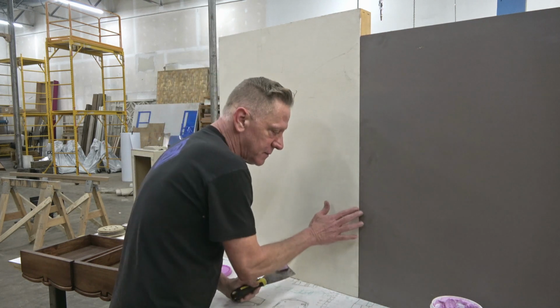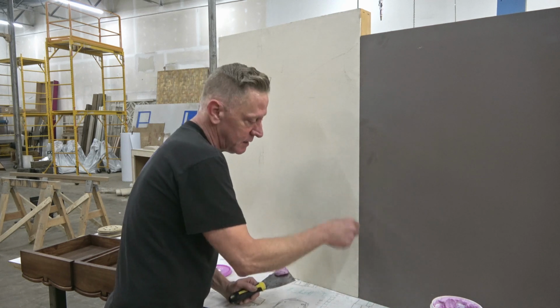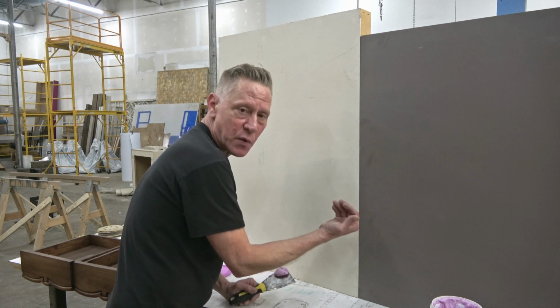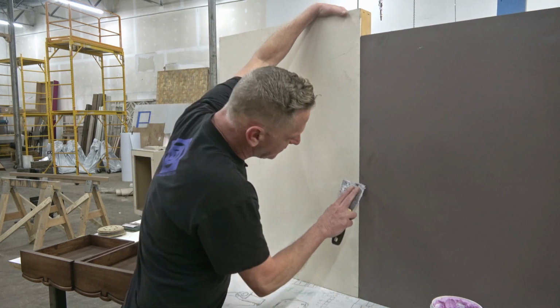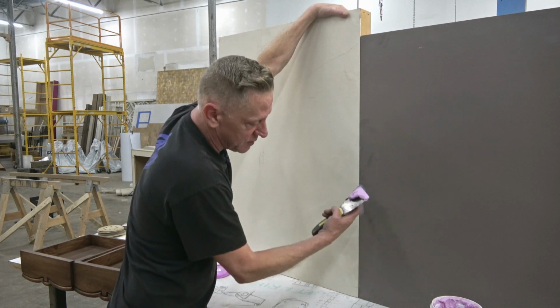And I can feel right here, between my bottom screw and my 2-foot screw, that this wall is a little bit proud. It's a little bit forward. So when I am spackling, there you can see the indication of which wall is proud.